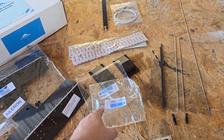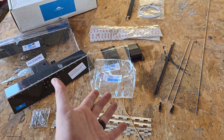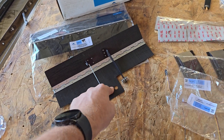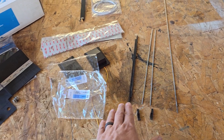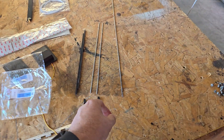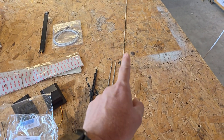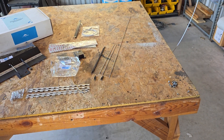The kit also comes with wires, which are already in the airplane — I decided that was pretty boring to show you since every airplane is different on how you run them, so I'll just show you the aftermath. Last, we have these extension push rods. They do come with little push rods already, but in our elevator situation we have to mount it a bit further forward of the trim tab itself. These are extensions for it, but in my case this wasn't quite long enough, so I went to the hobby store and bought this longer one. We'll be able to cut it to size and make it work exactly how we want.